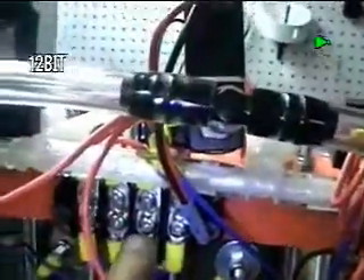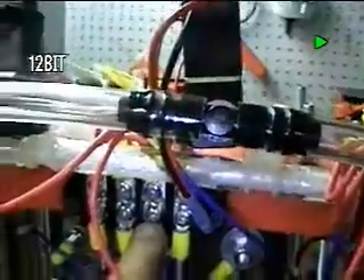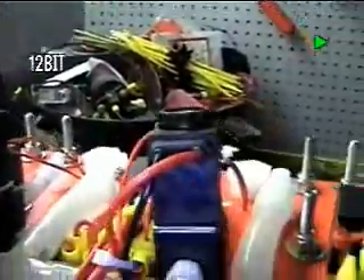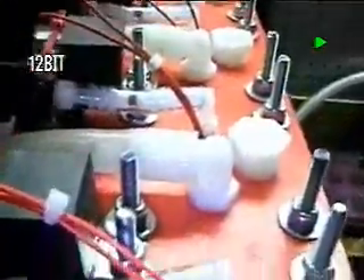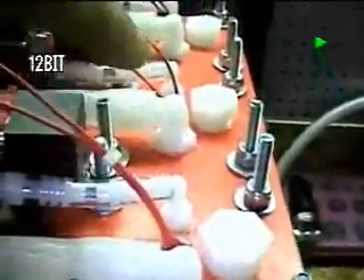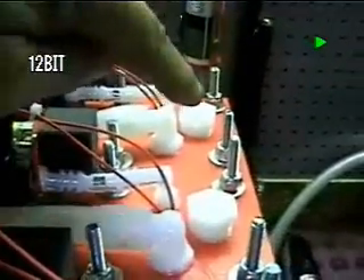Up here is your water control, your bus for your water control, which controls off of your solenoid valves — there are one, two, three, and four. If you look at them this way you'll be able to see all four of them. And of course they're all controlled by the four level sensor switches: one here, one there, one out there, and one out there. And of course here are your fill-in viewports across the four cells.